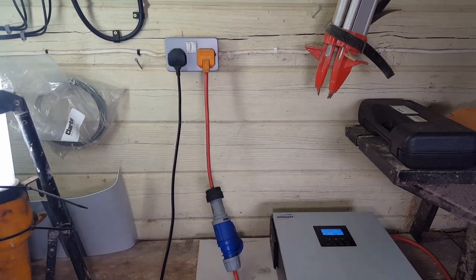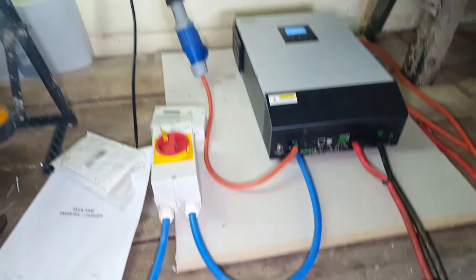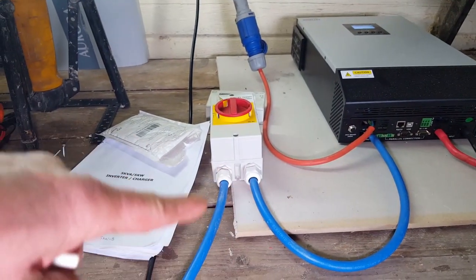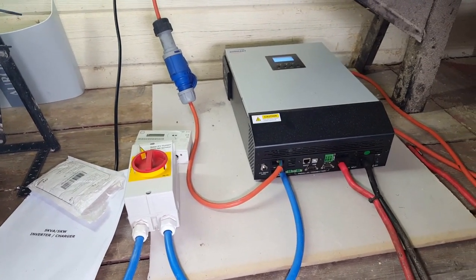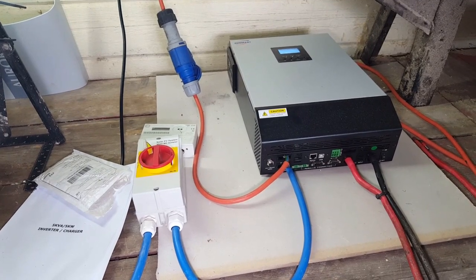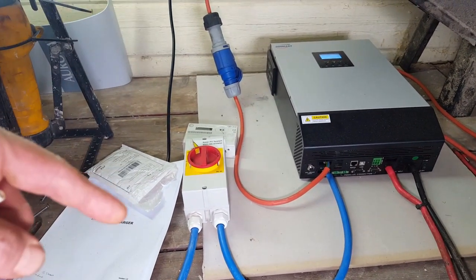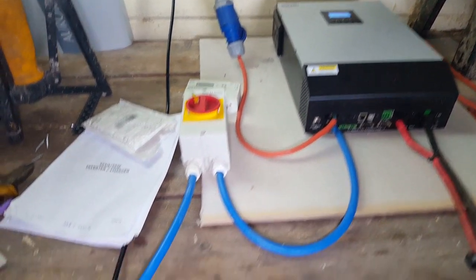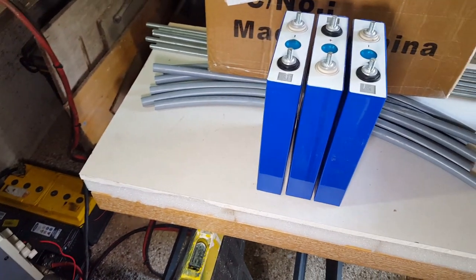What I've been doing for the last little while, whilst we have a little bit of power coming in, is just charging those batteries via plug socket. So it's a pretend grid — goes into that blue six-mil Arctic cable, off to the house, into an off-grid consumer unit with the breakers. For the last couple of months I've been running the fridge and freezer off of that, just to play with the system and see what happens — and also doing a lot of energy auditing and meter reading. Over about a day we're probably using a kilowatt or so in energy.